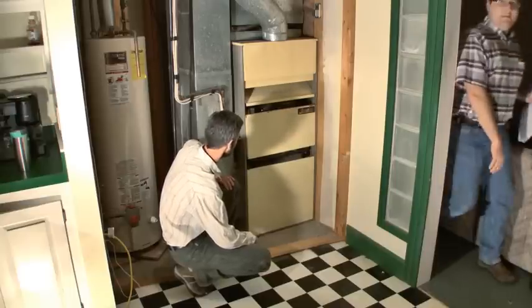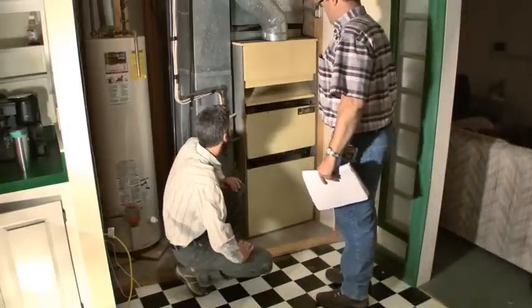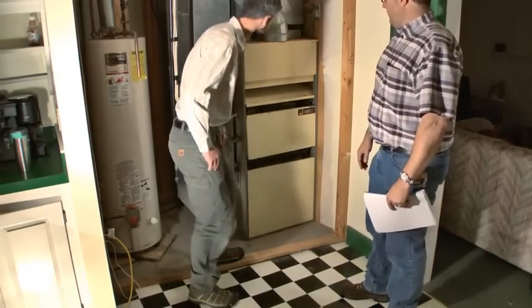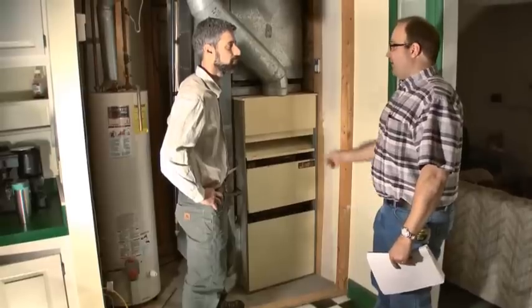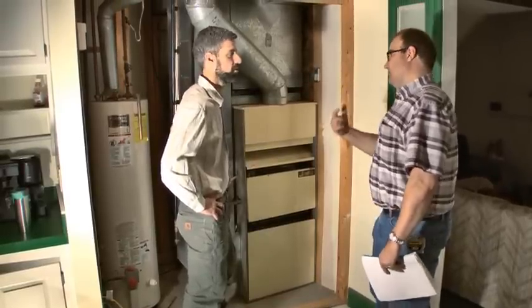That's a loud one — she purrs. So we've got it running. This is a natural gas system, so right now would be a really good time to go out to the gas meter and clock it to confirm the right amount of fuel being supplied to this furnace. Let's go check it out.